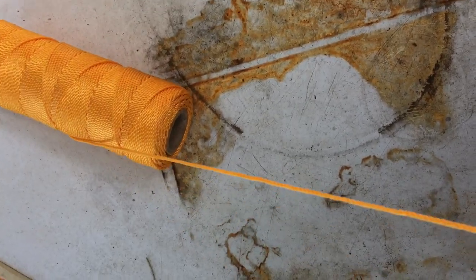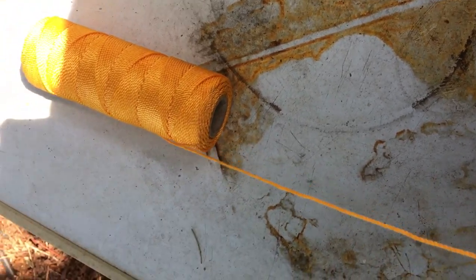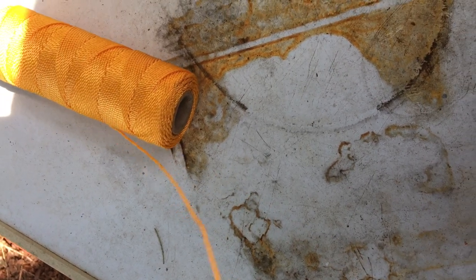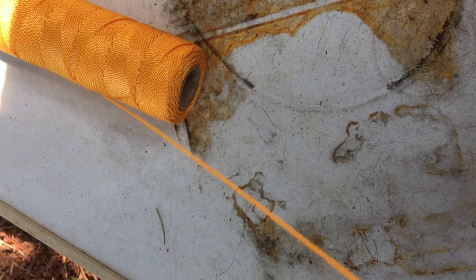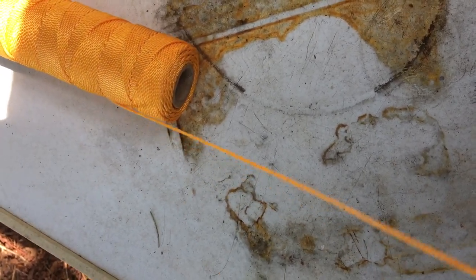Water is something we don't want to mess with our antenna, because now we're using spacers, of course, with the bottle caps. But if we weren't and we hooked it directly to the rope that we were using, and it rained that day, well, that could mess your SWR up entirely. So be sure to check your SWR when it rains, because you never know when things like that might happen.